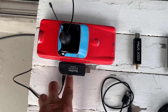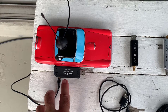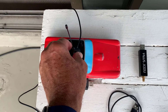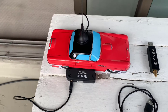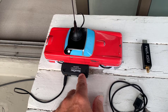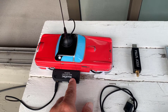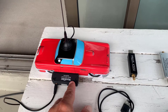This is the original RTL version that I got about eight or nine years ago. It's plastic, it has an MCX connector, and it came with this little 15 centimeter whip antenna which has a magnetic base so it sticks to metal and acts as a good ground plane. It has a frequency correction you need to take into account — about minus 27 parts per million — and it goes from about 25 megahertz up to 1750 megahertz.